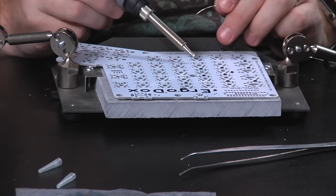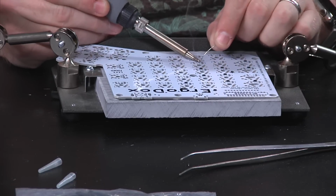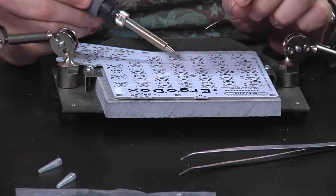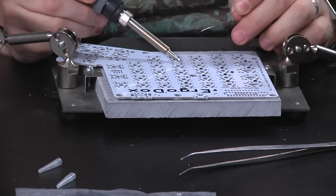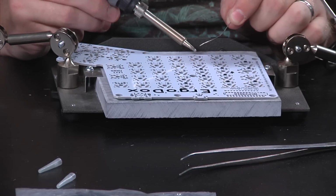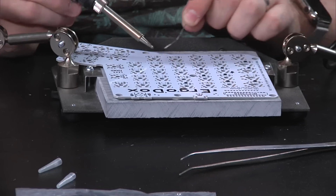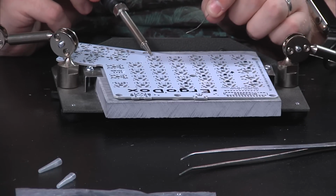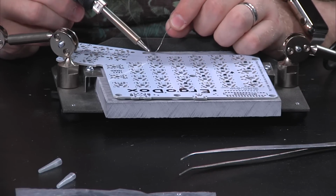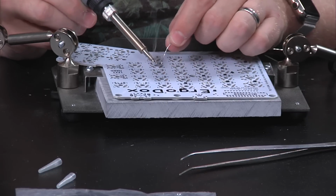So the nice thing is the pieces are small enough that they don't actually move off that much. I think this is clearly the worst part of today, of this week. If I had to guess, it's going to be today and tomorrow. So it just takes the tiniest amount of solder to tin these. I'm just getting it on the tip and kind of brushing it on them and it sticks. Then cleaning it off occasionally. Back on. This crappy Weller.